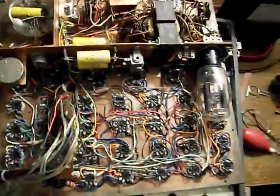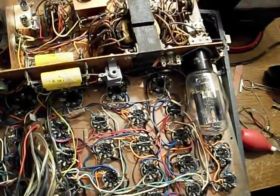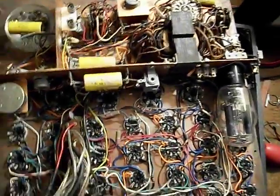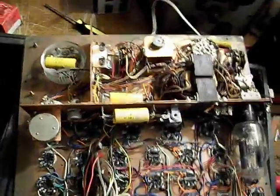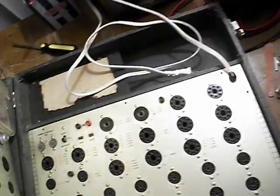These all have to do with calibration, which doesn't seem to be a very difficult process. We're getting pretty close. I'm sort of halfway tempted to pull this rectifier out and check the AC coming out of the power supply. But at this point I think there's probably more work in doing all that testing than just going ahead and replacing these caps and seeing what happens. Anyway, it's coming along, looking pretty good. More later, thank you.